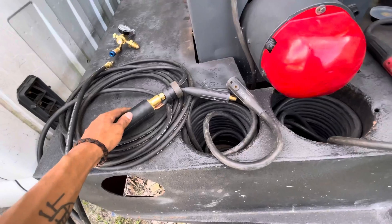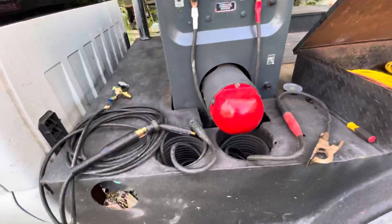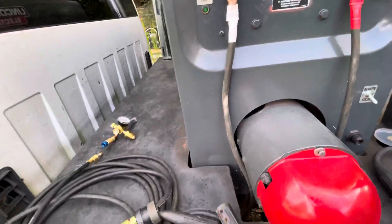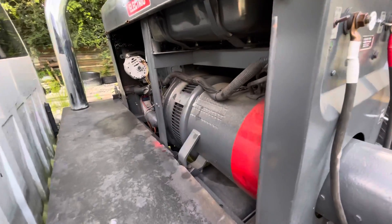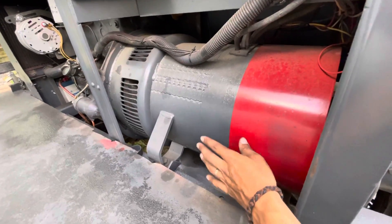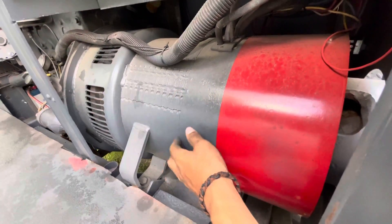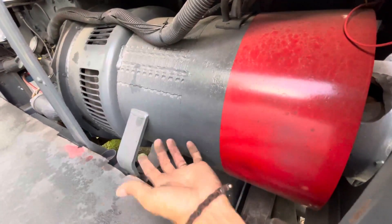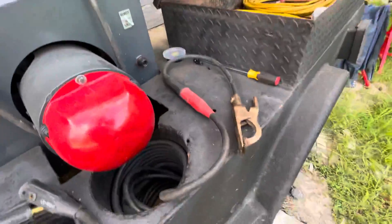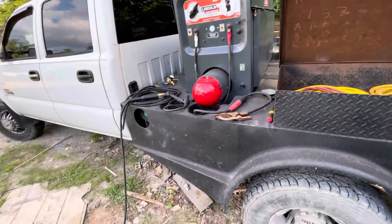That is the most basic and most reliable machine to run TIG on — and this thing runs nice. You can run it on auto or on high, super easy. Check out that round barrel — this is what a red face looks like. A lot of people ask what's the difference between a red face and a black face. This is a red face — the barrel is round. The black face has little angles on it, they call them hex barrels. Super easy to tell apart.